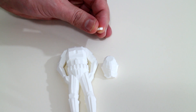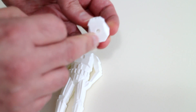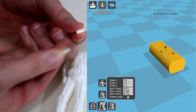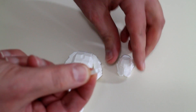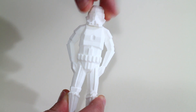The walls are quite straight all the way up, which tells me that the tolerance of this PLA must be pretty tight. Now originally I printed the connector at 100% scale — in fact all pieces are at 100% scale — however I'm unable to fit the connector inside the main body, nor underneath the head. So what I did is print it again at 90% scale. In Cura I just changed it from 1.0 to 0.9, and now it fits into the head much better. It's still a tight fit but it actually fits into the head and also into the main body. And the head articulates — it can turn left and it can turn right. Cool.